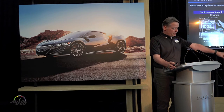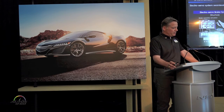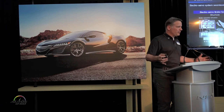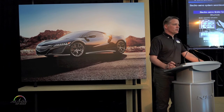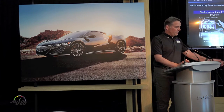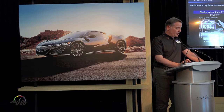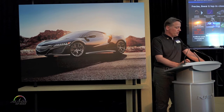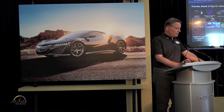In the lower portion of the left side, you see the tandem master cylinder. We have a very precise and adaptable way to seamlessly integrate motor brake force with the hydraulic force demanded of the powerful Brembo brakes. This circuit on the lower left generates hydraulic power to the Brembo brakes and mixes it with what we're regenerating from the motors. Hopefully it feels invisible to you.